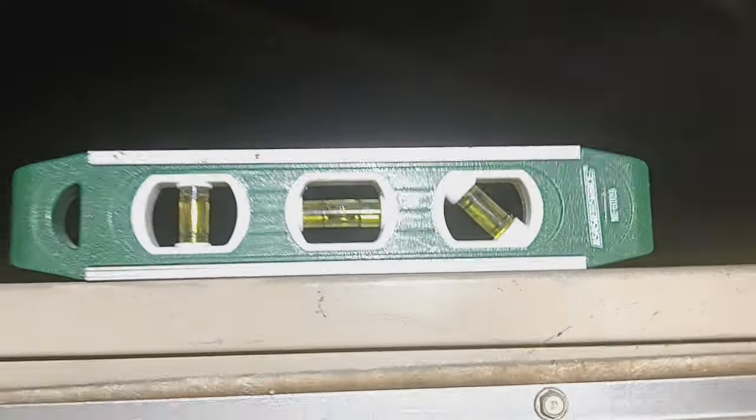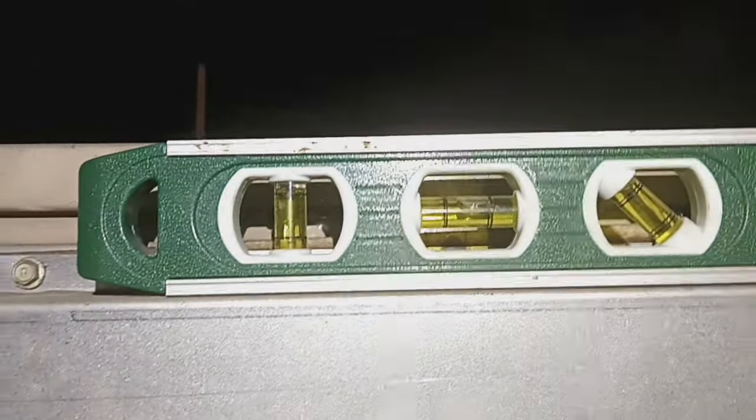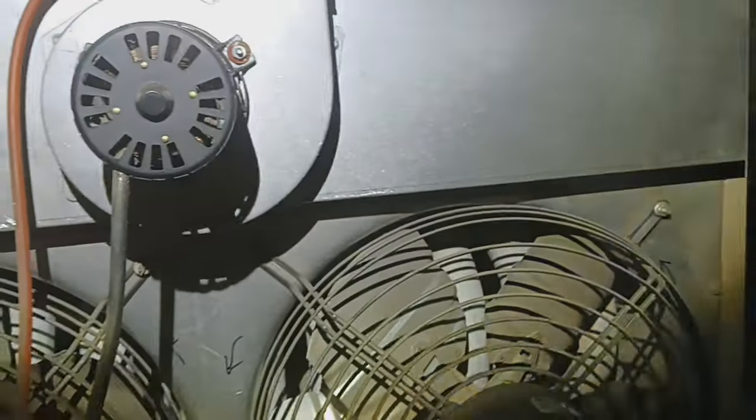Take a look at this — that's level, so the cabinet held level. But this thing is no longer reflecting that. It's about four feet wide, and you've got a half inch pitch because we're touching the line — so we've dropped on this side.